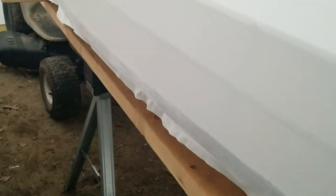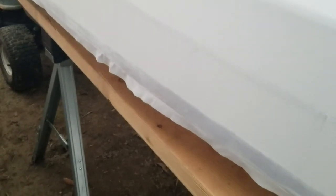about every 3 to 4 inches, I would tack it in for about 3 or 4 inches. Being very careful to try to leave any wrinkling evenly between each of the tack points. Then what I would do is I would skip about a foot and a half between the midsection and the bow and the stern. And I would stretch that fabric over the bow or stern and attach it to the side of the stem.